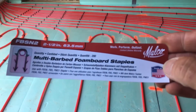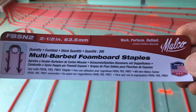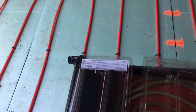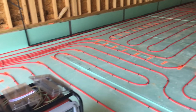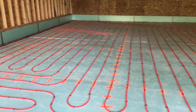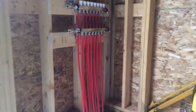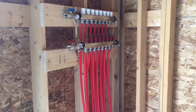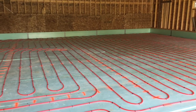The staples are $25 a package — four packs is $100. Malco is the company, two and a half inch for two-inch foam board. If you're using one-inch foam board you'd want inch-and-a-half staples. I'll try to get some shots when they pour this floor, and I might make a short video on pressure testing. That'll be my next endeavor. Like and subscribe if you like these simple videos — thanks, bye.